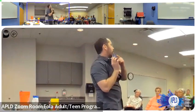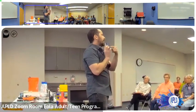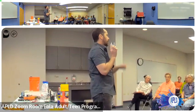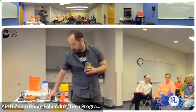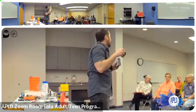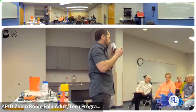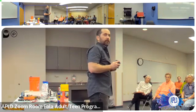This device measures the amount going out and the amount coming back. And if it senses any difference between those two, it shuts off. Okay? When these shut off, sometimes they trip these. Sometimes they don't, but that doesn't indicate a problem. When this trips, you don't need to call an electrician in panic. Okay? I want to see it.